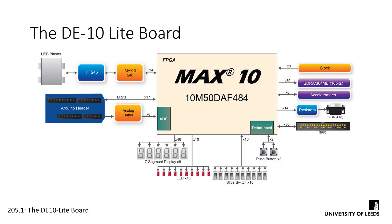Let's have a quick look at the basic block diagram for the board, where we can see our inputs and outputs connecting to the FPGA chip. The only major things to note here are that our ADC is actually part of the MAX10 chip — we don't need any external ADCs, just a bit of buffering to regulate the signal. And then we have some baked-in debouncing circuitry for the buttons, because as we're going to be running this device at very high speeds, any short flickers on the button inputs could have serious repercussions on the input detected in our designs.